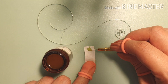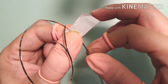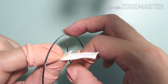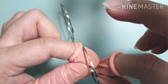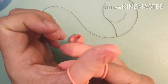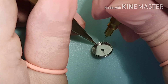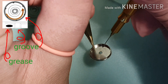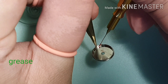I'm gonna start with lubricating the mainspring. I'm using Mobius 8200. I put some of the lubricant on the watchmaker paper and run it through the whole length of the mainspring. I always change new finger cots. I'm putting braking grease Mobius 8212 onto the wall of the barrel, since the mainspring will be coiled counterclockwise. The braking grease should be put on the left-hand side of the groove of the barrel.